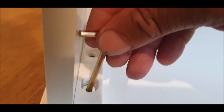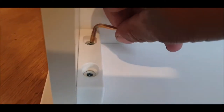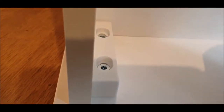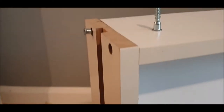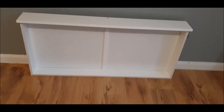My next little tip: if you're using your allen key and you find you're coming up against the edge, sit it in there properly. Don't go too mental when tightening it. You'll hear the wood start to creak as it pulls in tight — once it gets to that stage, my advice is to stop. Anyway, we're going to put in these last two now. There's the drawer all together, good to go.